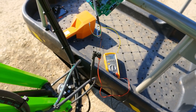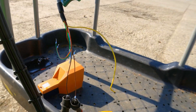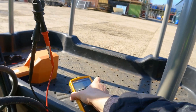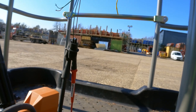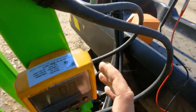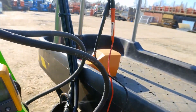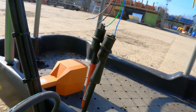I'm going to do a resistance test now. Checking the brown and black pair - the resistance on that is 0.8 ohms at the moment. The brown and black should be around 1 ohm or less, so it's pretty much a short circuit as expected. I'll move the wires around just to see if that changes anything, but that seems to be good - no problems on the black and brown.